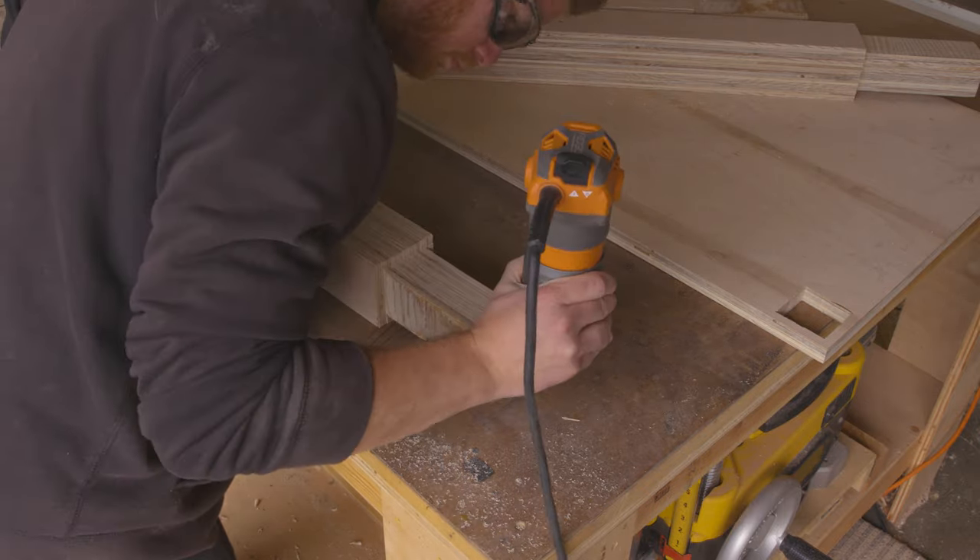While the leg assembly was drying, I decided now was a good time to glue in the posts. I added glue and friction fit them to the platform. These pieces are extra important to make sure they are square so that the top rails go in square as well, so I took some extra time before clamping to check and recheck that they were. I added clamps in from both directions so that there was equal force to make sure that they dried square, then used a wet rag to clean up the squeeze out. Once those dried, I could add the platform to the legs. I set the platform on the tenons, then used a glue brush to apply a liberal amount of glue and used bar clamps to pull it all together. I moved the bed out to the driveway to glue on the new veneers, used a glue brush to apply plenty of glue, then clamped them to the tenons using as many clamps as needed to close any gaps. After everything was dry, I used a flush trim bit in my router to take off the excess veneer material, then used a chisel and a mallet to clean up the edges.